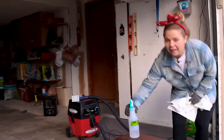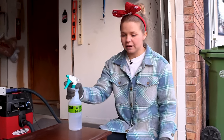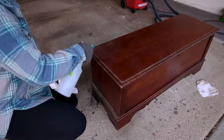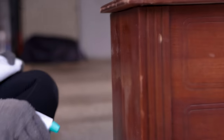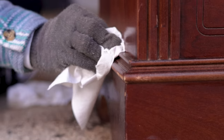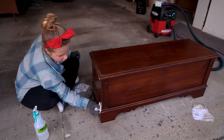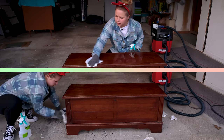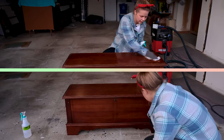Of course though, we've got to get the prep done. Let's clean. I'm going to use some white lightning that I've already got mixed up in my spray bottle, and as you can see this piece is not clean. It's very dusty and probably also has some oils and grease on it, which we want to completely eliminate so that the paint can adhere. I'm also going to rinse off all of that cleaner so there's no leftover residue.